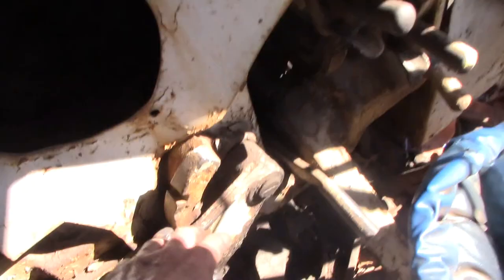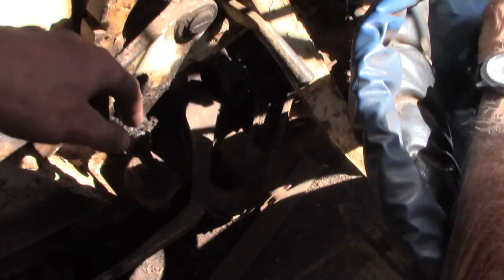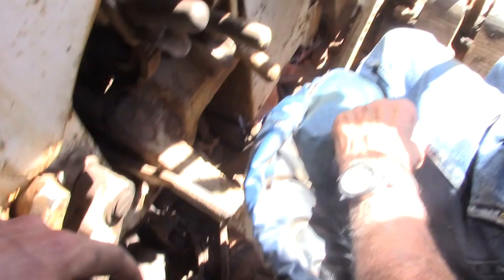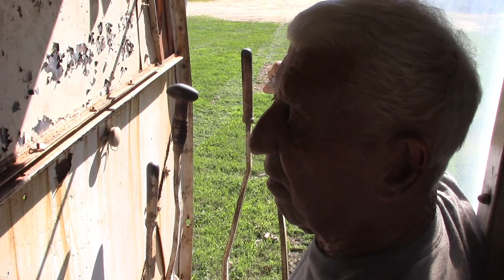So to summarize: this is swing — it's out right now, click it in and it'll be in swing. That's got to be out when you're swinging. If you want to swing, you click that down and click this up. Main engine clutch, swing brake — they call it house lock or swing brake. Travel brake down there. Once you run this machine you'll pick all this up. It's a mechanical device — that's what it is. That's why it's still around. Imagine: a 1954 machine. It picked up that big engine no problem — Fairbanks, yeah.